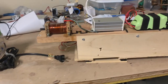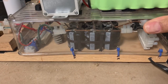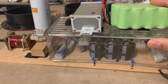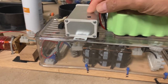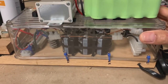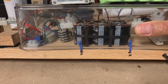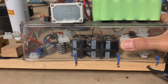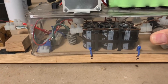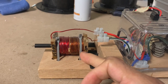Let me tell you a little about these magnetic guns. They take the energy from the battery pack — this is like a 12-volt battery pack — that energy is converted into a much higher DC voltage using a boost converter, and this generates 390 volts from 12 volts. That DC electricity is stored in a capacitor bank, so this 390 volts charges up the capacitor bank, which stores quite a bit of energy, and that energy needs to be suddenly discharged into this coil to generate a very high magnetic field.